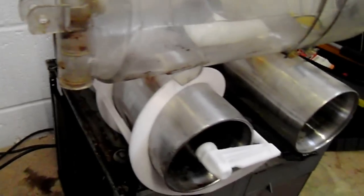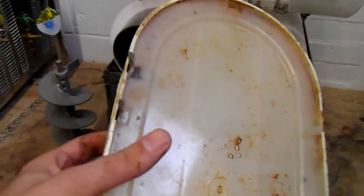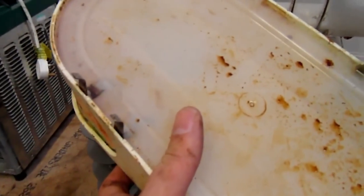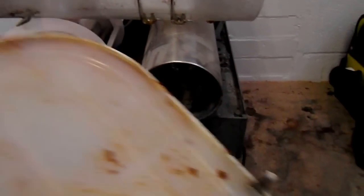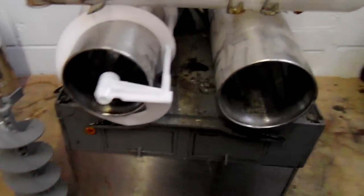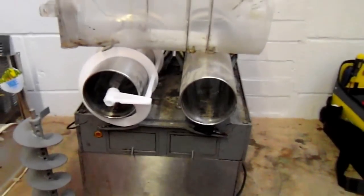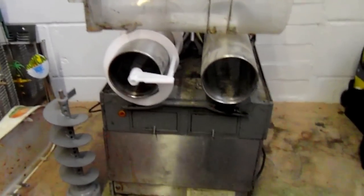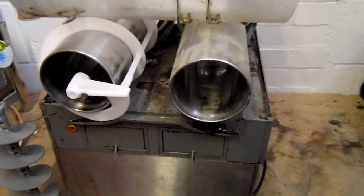Now if you look at the overall condition of this lid, as you can see, again, it's not in the best condition. These are the contactors here, which line up with the contactors on here, and two of these on this machine are for the lights, and two of them are for the safety feature to cut off the power to the gear motors, to prevent someone from hurting themselves when putting their hands inside the tank for filling. In our next video we'll go through exactly what we do with all these components, what we're going to do now with this machine, and how it's going to look in the second stage of the repair process.